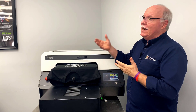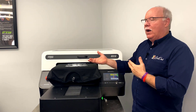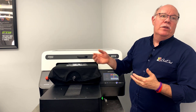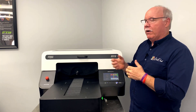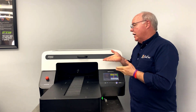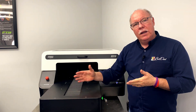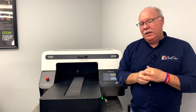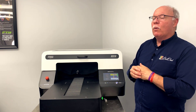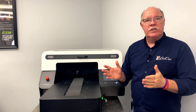Another thing that's changed in the printers is how fast the white ink sets up, which allows us to print faster, because we have to print a white layer and then a color layer. If the white ink doesn't set fast enough, we're going to have a situation where the color goes on top and you don't get a good set. Also, if you noticed, when we came out here, we printed and as soon as it finished the white, it immediately drew the platen back inside and started printing the color layer. On earlier generations of printers, you would have a full finish of the page and then a full reload, which was very slow.